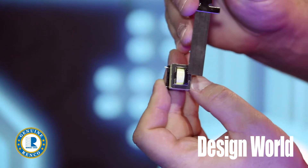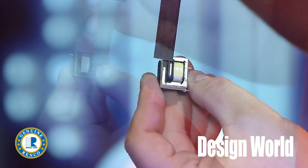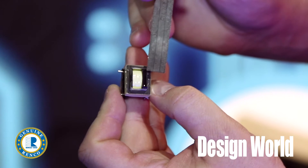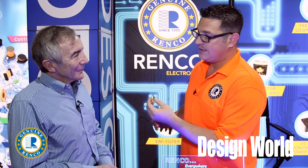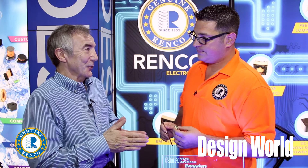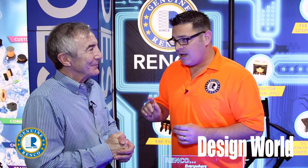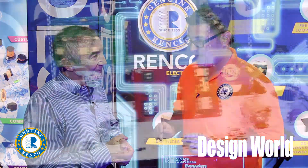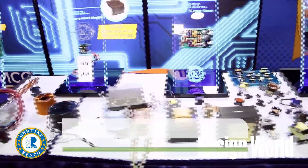We now offer this with both the 300 volt and 600 volt spacings. And some people ask how we achieved the 600 volt spacings. The way we did that was we actually encapsulated the one turn primary on the top side, and that provides us the creepage and clearance we need to the secondary winding to meet that 600 volt requirement. And just so we're clear — the traditional current transformer, there's just no way they can meet those UL standards? That's not necessarily true, because with the traditional toroid you can meet those spacings. But this offers the fully PC-mountable version with all those affordabilities.